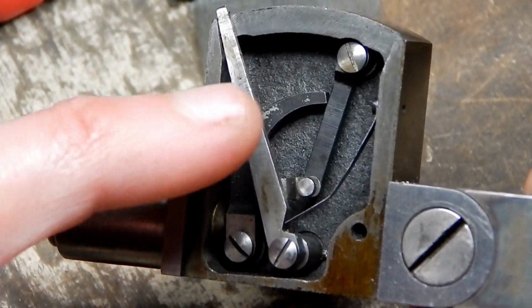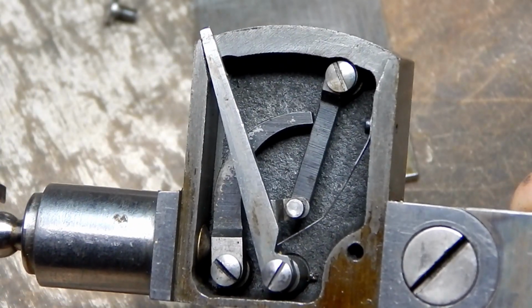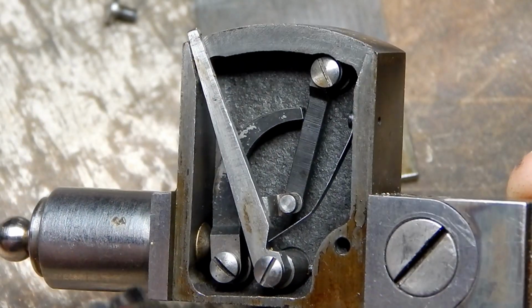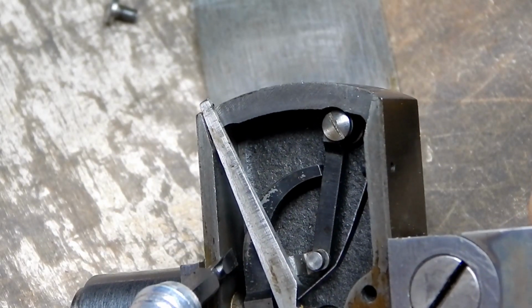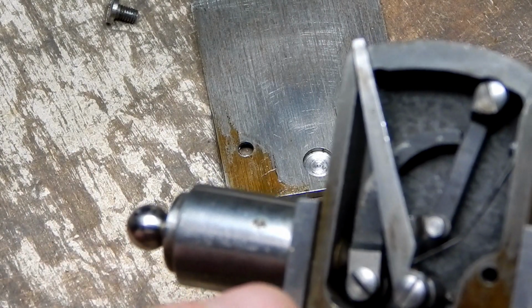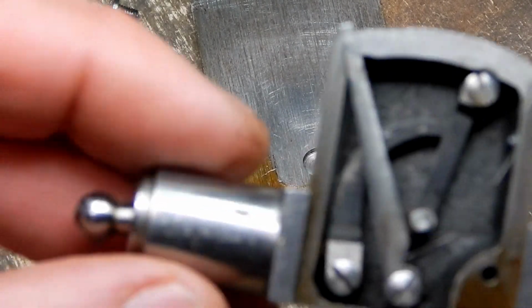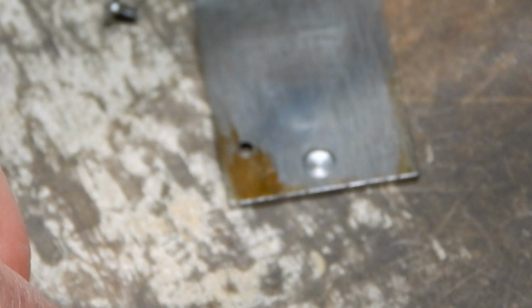All right, so I see nothing inside here that would cause this needle to deflect for any other motion of this ball other than directly in this direction, because it's basically just a plunger or a pin with a convex end on it that's going to push on this arm right here, and that's what's doing the deal. So if this motion like this is supposed to be transferred into motion like this, that would be happening inside this nose of the unit here, and not inside here. So with that being said, I'm going to put this back together.